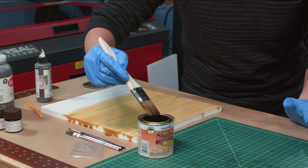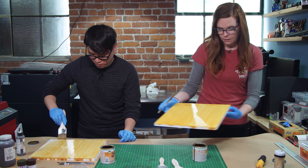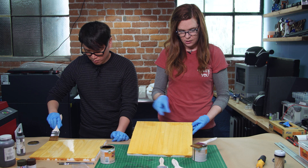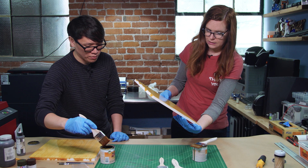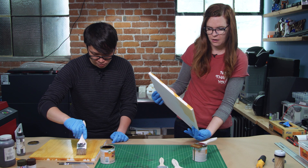I've got a good base coat on here. You can still see the pencil lines I made originally — these are about an inch apart for my slats. You can do that at any size; you could make variations, a fat board, a skinny board. What's great is because the shellac is semi-transparent, I can make these lines ahead of time and paint right over them, and I'll still have them marked out. You can see because it's a bit liquidy, as I tilt it, it flows.